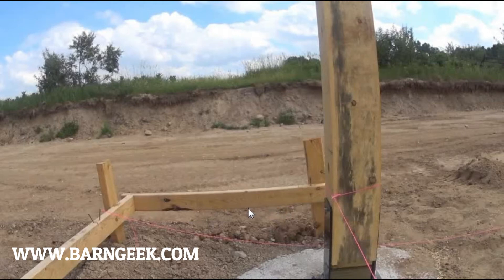You also need to make the strings the correct dimensions. You need to lay them out initially to be the exact size of the barn, as printed on the plans — that will be the whole measurement. So say this barn is, just for an example, 36 by 50. The 36 by 50 dimension is to the posts — it's the outside of the posts to the outside of the posts: 36 feet wide, 50 feet long. That's where you need to set your strings. Keep in mind that the U bracket is not exactly the same as the post because it's a quarter inch thicker, so you're going to want to set the U bracket on the outside of the string. Basically first you just need to set up the batter board to give you the outside dimensions of your particular barn, which you can find on your plans.